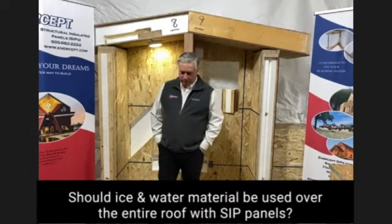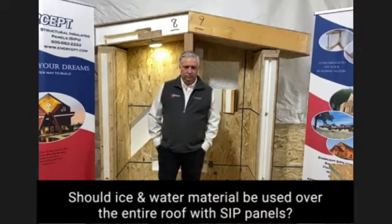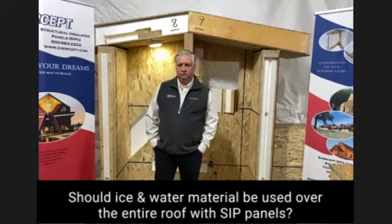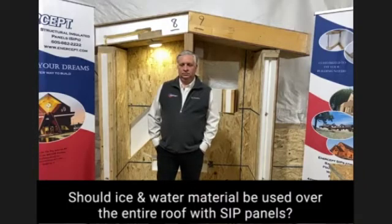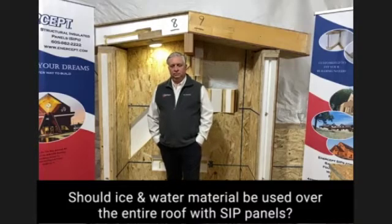The reason most metal roofing manufacturers require peel-and-stick membranes applied over the deck is that their metal systems leak, and it's the ice and water shield underneath with the low perm rating that keeps the water out of the roof assembly. The technical bulletin talks about that drying concern. A suggested way to deal with this — and I can send you an email outlining this through Dawn — involves two options.